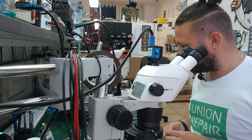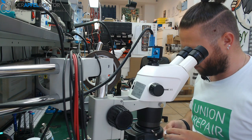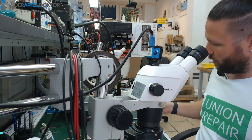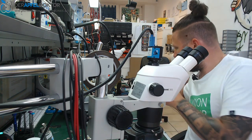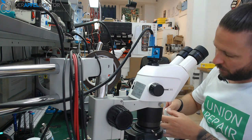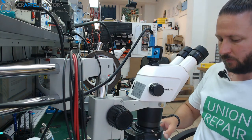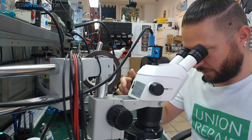Problem on the original board is that we got a short on 1v8 IO. It was a trace damage, so it is unfixable. So we just swap the CPU and the logic EEPROM on the top layer of the board, and we should be back to life again.